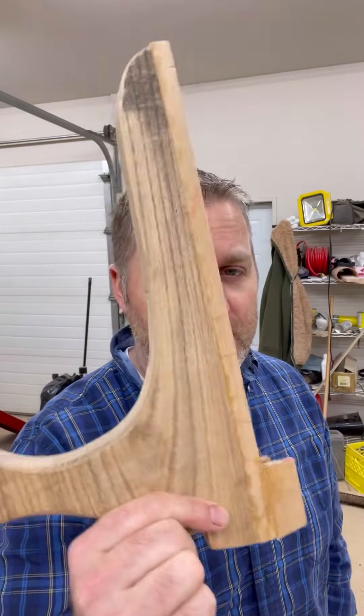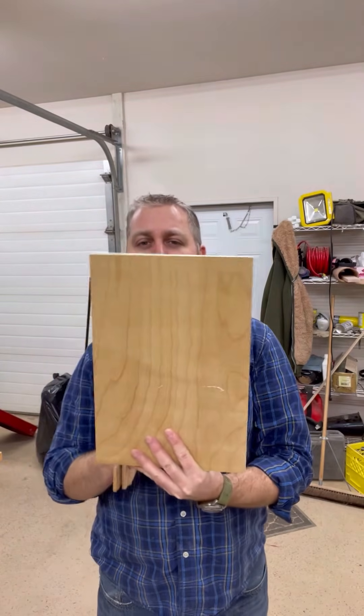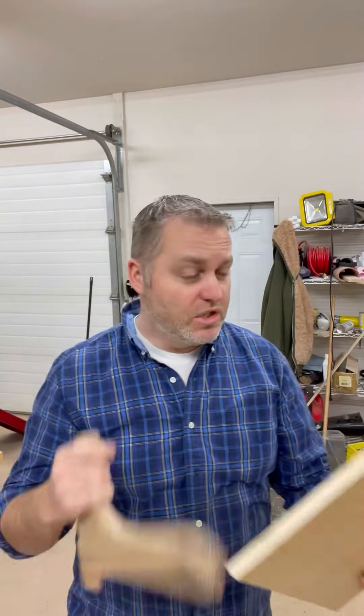That's less of an issue with these style of push sticks that have a little bit of downforce on the front, because you do have a little bit more control on your material. However, physics is physics. You have essentially a rotational point here, and if you're pushing on this side the piece will rotate this way, and if you're pushing on the other side it rotates the other way. So the way you want your push stick is pushing closer to the blade than the center of the material, because that will rotate it into the fence, keep it pushed up against the fence, and make it less likely to rotate into the blade causing kickback.